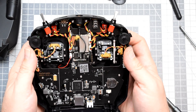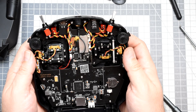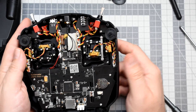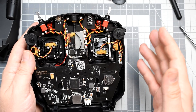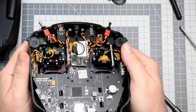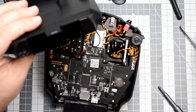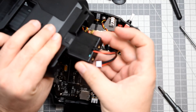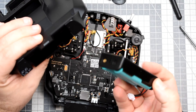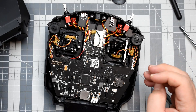So this is how the RadioMaster TX12 is built internally: a castrated multi-protocol module with nice PCB quality, and gimbals which really match the price of the radio. They feel better than the gimbals on the FlySky i6. However, they are potentiometer gimbals, not hall effect, so you can't compare them with higher-end radios. The battery compartment is tight — but that means no batteries rattling inside the casing, so maybe that's intentional.